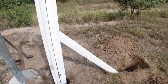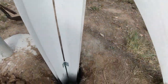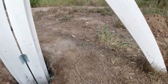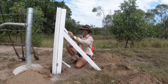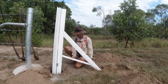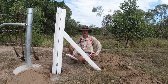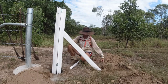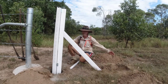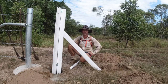What I'll do now is fit these brackets on. There's an inch piece that goes in there as a stiffener, and there's one that goes across the bottom. There's a hole at the bottom and it goes across there. The one with the three holes — the inch piece — slots in there and bolts up to there. The one at 45 goes under there and down like that, so that stiffens it all together. About this hole, I had to go an extra four inches deeper because I'm on a bit of a slope. So those measurements I gave you were ballpark — if you drill them out as per those measurements you're going to be within four inches anyway, unless you're on a real steep incline.